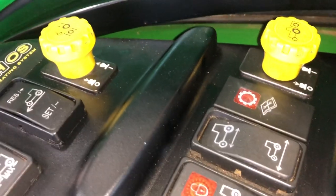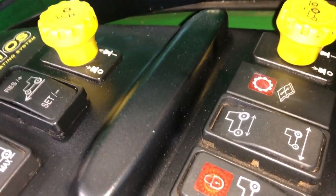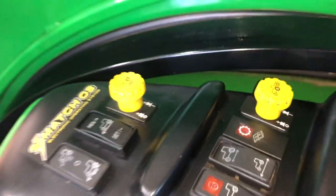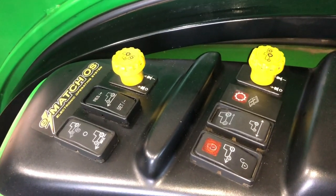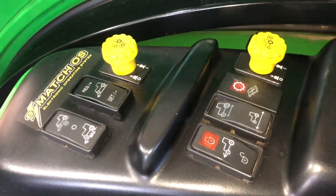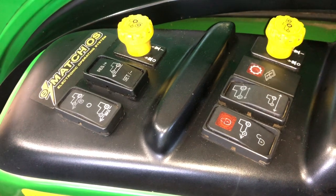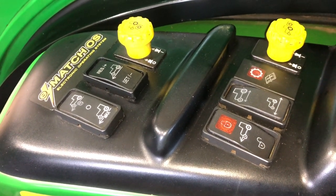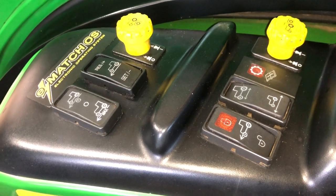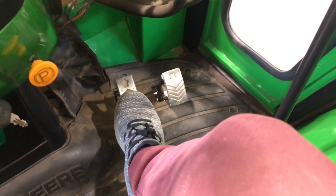That's how you troubleshoot this entire controller with its 10 or so onboard sensors. The service manual will give you much more detail on the high-level overview. This system is all electronic — every sensor gets about 5 volts and a ground. If it's an on/off sensor, the back-feed wire gives it 5 volts for 'on' or no volts for 'off.' If it's a variable sensor, it's going to be anywhere from 0.5 to 4.5 volts back to the controller. That's the entire way this works.